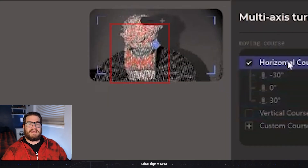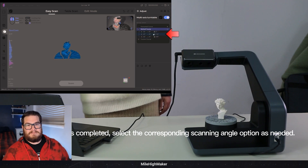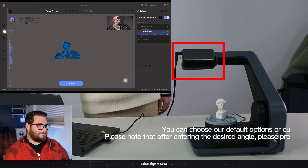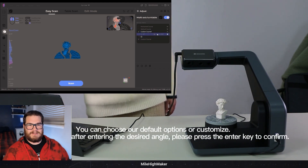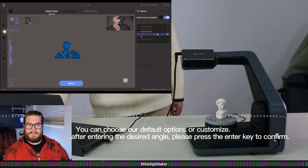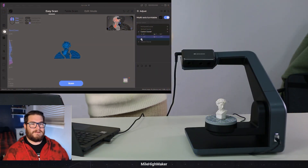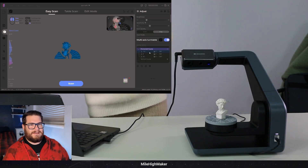You can see the model they are scanning is very white and very matte, and I think it's actually overexposed - you can see the red starting to clip out on that model. And they've tilted the scanner right over here, it's not in line with the arm because they had to get it on that table. They're probably naming it to save it. Oh - they made a custom profile. I don't know why they only did halfway up and halfway that way - this is only like half the bottle and then a full rotation.